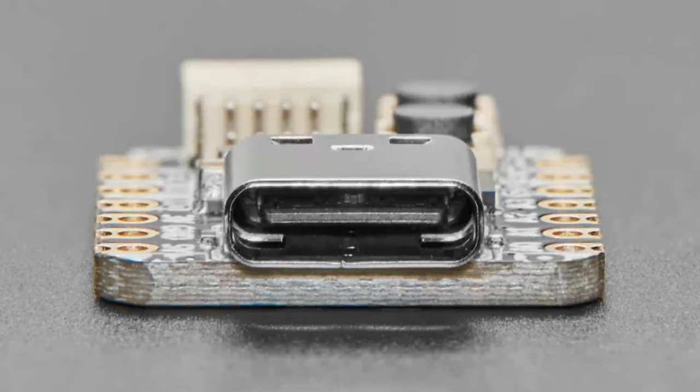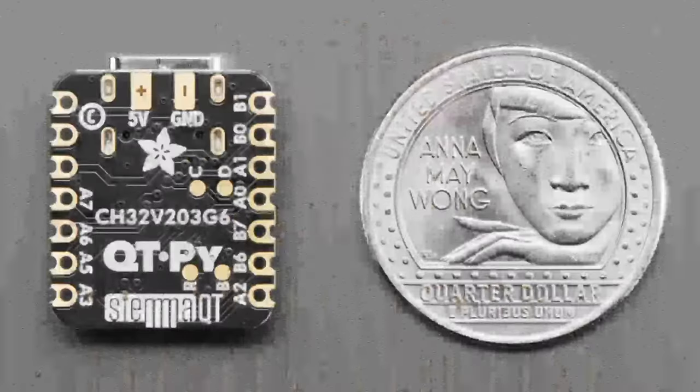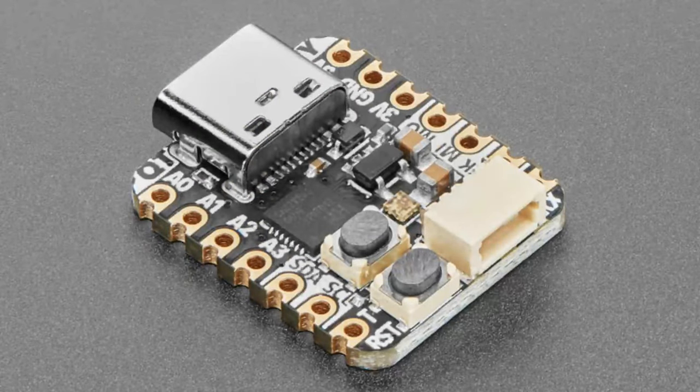We added TinyUSB support for it, thanks to some contributors, and Tech merged it in. We've also worked on making the Arduino support better. It's still a hacky chip. It's not for beginners because it doesn't have auto reset built in and some peripherals are kind of funky and don't work. But it's a pretty nicely featured microcontroller board. I think there's this future of ultra low cost RISC-V chips that are going to hit the market. People have been experimenting with this board using CNLohr's ch32v003fun repo, and that's great if you want to use makefiles.